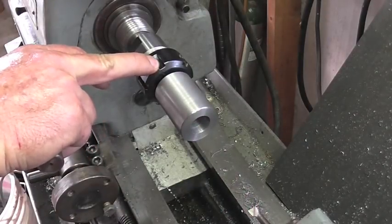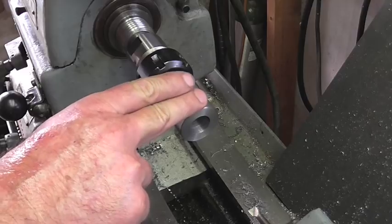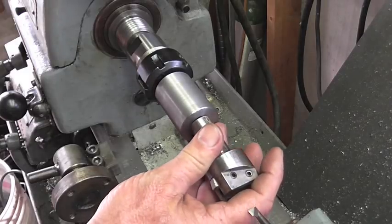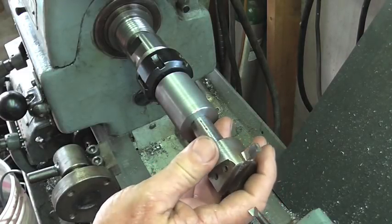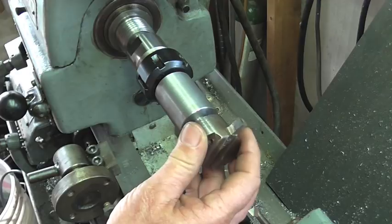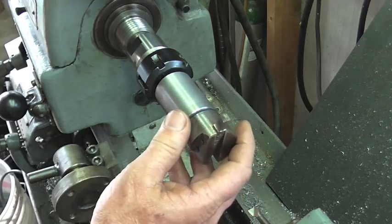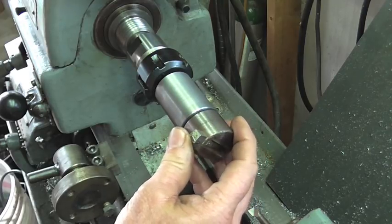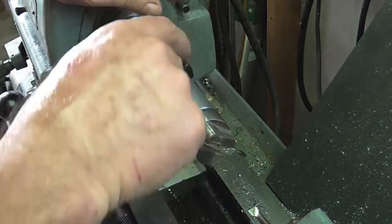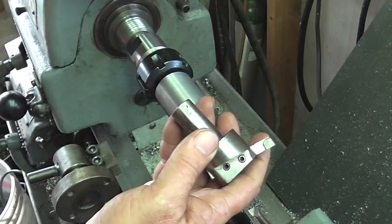We've got the 5/8 shaft that was turned in between centers inside the collet. The OD was turned in this collet as well as boring the center. So with the equipment that I have, that's about as concentric as I can make it. And that's a nice slip fit. There's really no play. So the next operation is to take this over to the mill. We'll go ahead and drill it out for 2 set screws to rest up against this flat, and we're going to give it a whirl.